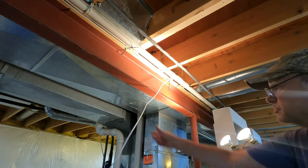They have various coil voltages to choose from, and their contacts are rated for motor control. Both of these models are plenum rated, so they can be used in an air handling system. Both are UL listed. However, I selected the RIB2401D because it has double pole contacts. The other relay would be fine if I only wanted one normally open contact, but I want two.